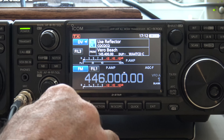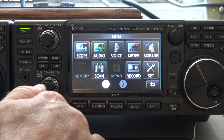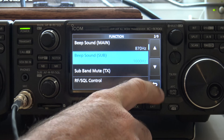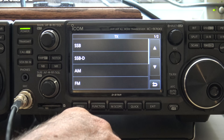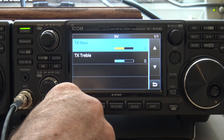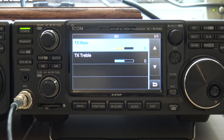But on DSTAR also, if you want to make sure that you sound really good — if you have one of those voices that collides, where your voice is a frequency that's muddy on DSTAR and you talk monotone — go to set, go to tone control, and set your transmit and receive on DV for bass and treble. You could also do it for FM or AM sideband. Set your DV to what sounds good, ask for somebody's opinion. Maybe you're too bassy already, dial the bass down. Get it sounding good and you'll get a lot of contacts that appreciate talking to you with a good-sounding radio like this.